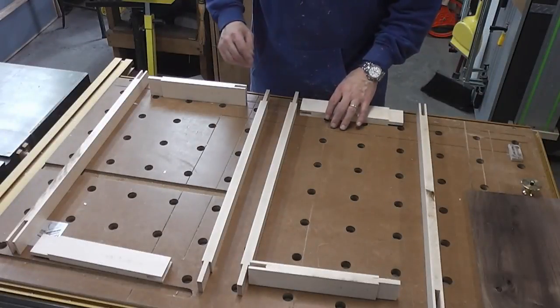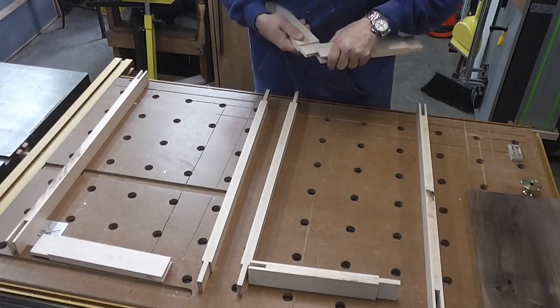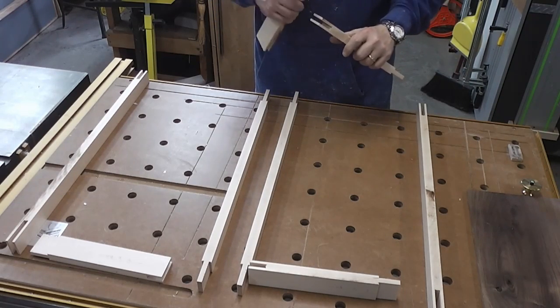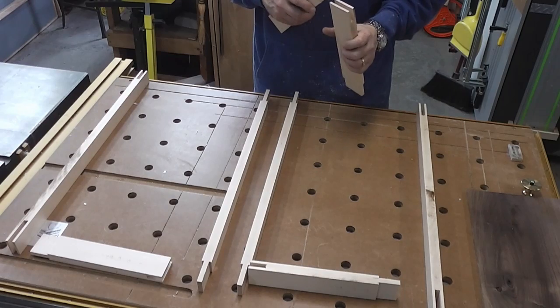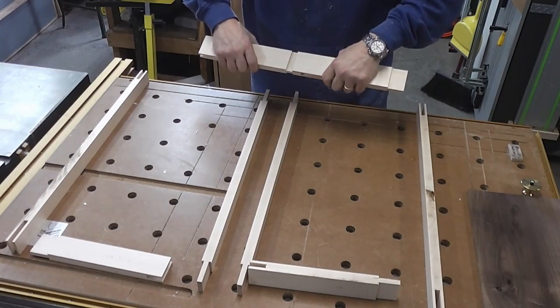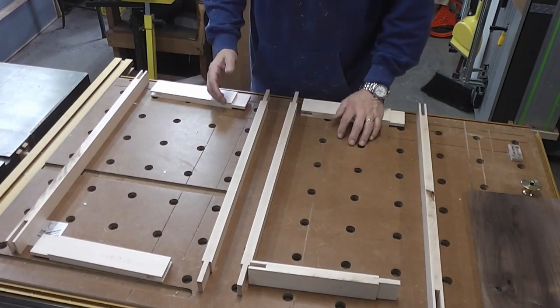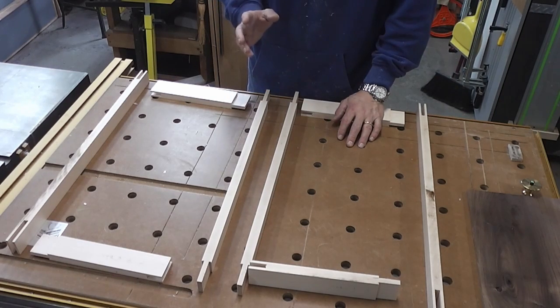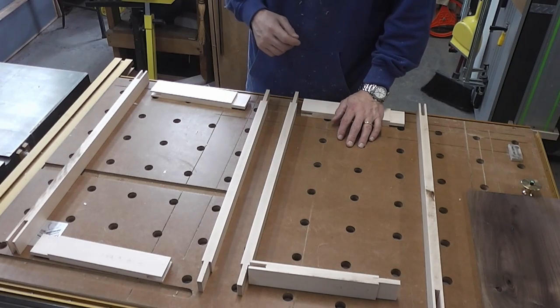While the piece is cut up, I still need to do the final milling on these. This is the fit — it's pretty tight, and that's by design. I'll need to hand fit each one of these to the individual mortises and tenons, and I'll do that with a block plane, a shoulder plane, and some chisels. That's going to take a little while because it's hard maple and it's very difficult to work. This was pretty complicated — there were multiple setups because I had different size outside stiles, inside stiles, the rails were different sizes, and everything required its own special setup except for the width. But the end result of this is going to be, I think, pretty nice.